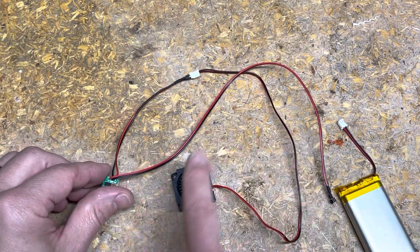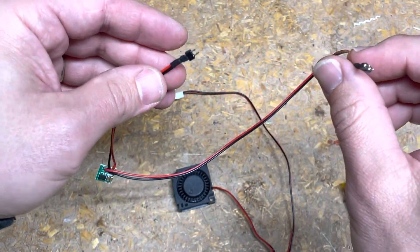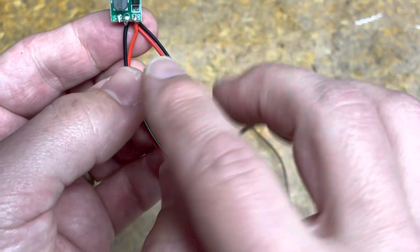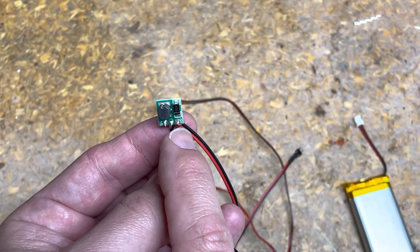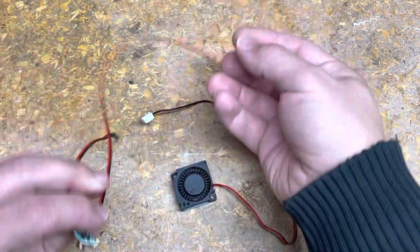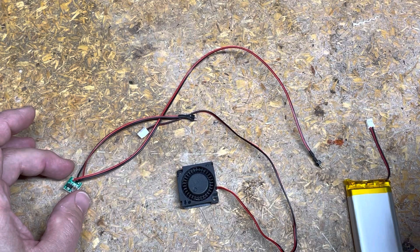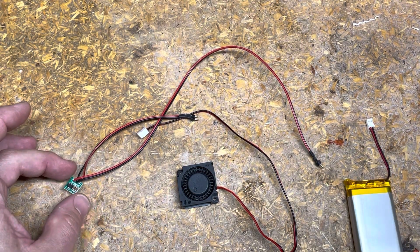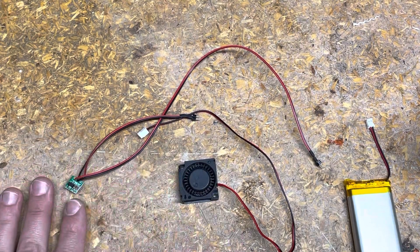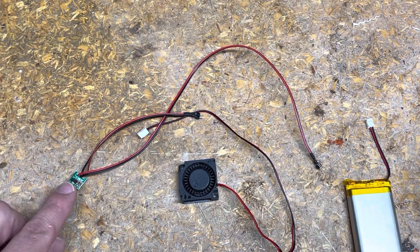All I did was solder two wires — these are just spares I cut from previous stuff. The board essentially has a voltage in and a voltage out, and in the middle is a ground, so it's only three holes. Your voltage in comes from your battery and your voltage out goes to your fan. The Commidox board — C-O-M-I-D-O-X — automatically converts anything under 5 volts up to 5 volts specifically, which is exactly what this fan needs. And it has the smallest footprint.